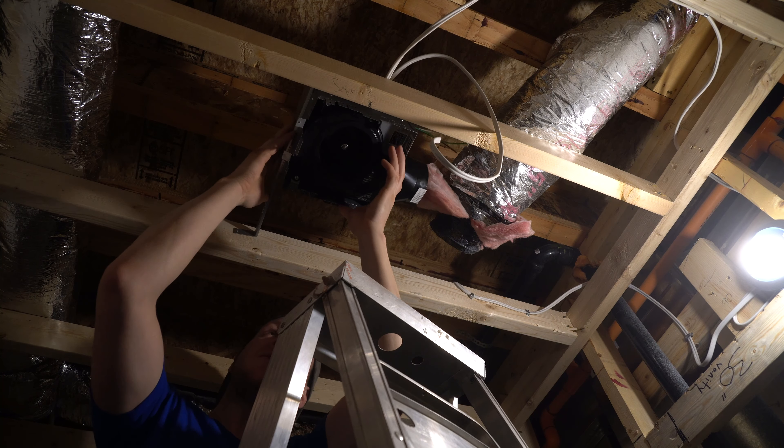This side I don't need to do because this side isn't going against the stud. But if you have sheetrock, depending on what sheetrock you're going to do, you bend that tab out — this will help you set your heights. Now we can mount that right here and line this up in the center.